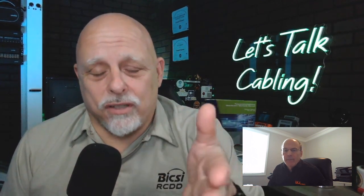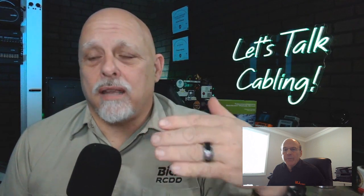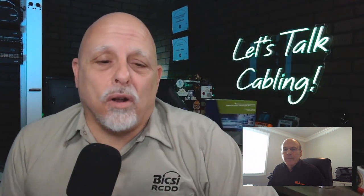Gotcha. It brings up a great point. Obviously, they're sending it in often because of that environment, but for the person who's not fusion splicing in a coal plant, is there a certain time frame where they should send it back to you guys for alignment or calibration? We ask our customers once a year, every 12 months, to send it back to us for a deep cleaning and deep calibration. That is included with the first 3 years of the warranty on the machine. After that, we keep the cost to a minimum per hour, and it usually takes about an hour.